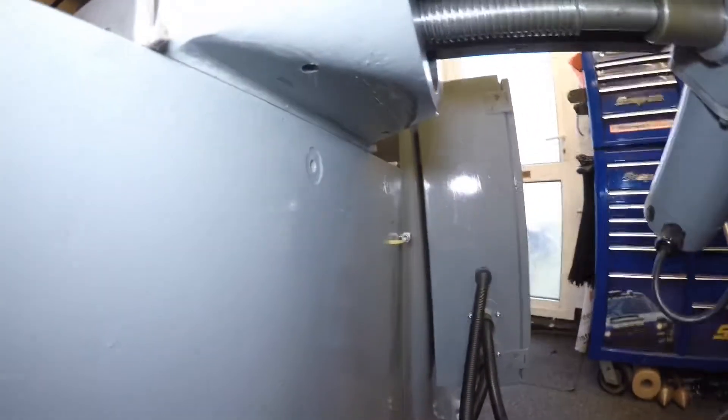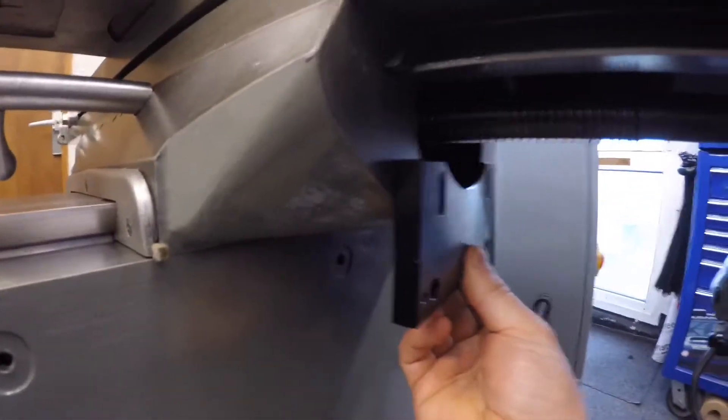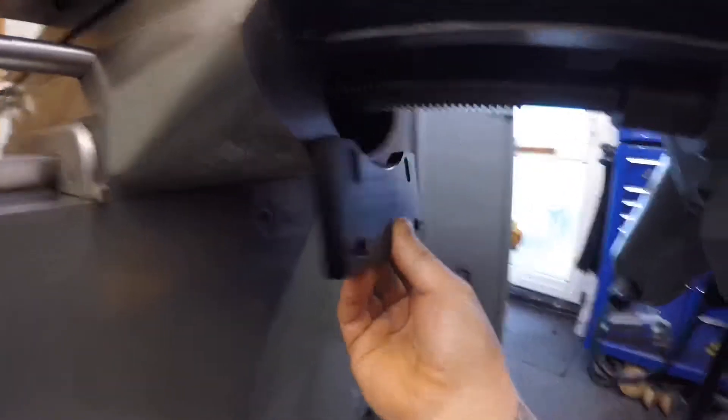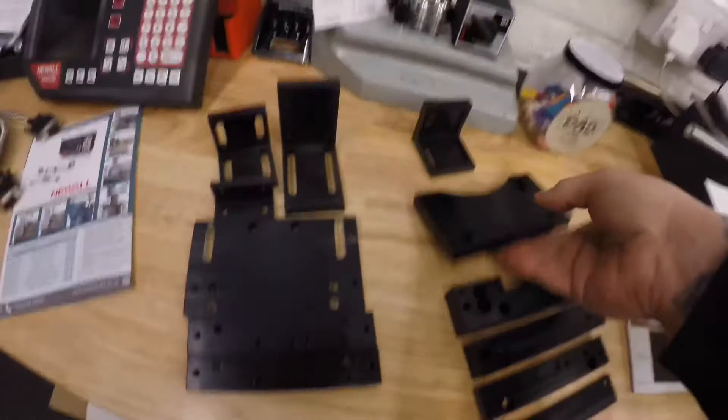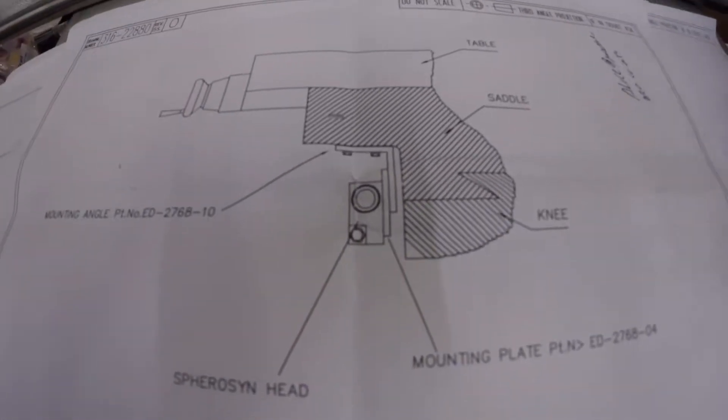I looked at the underside of the saddle and it's not very flat - it's angled. So I phoned them back and said that's the wrong kit. They said no it isn't, then I went on the website and showed them their own photos - and they agreed. They sent out this bracket which will mount on the side, and your reader head comes off of there. If you buy one of these, be aware they may send you the generic kit when really, for a Bridgeport-specific install, you want this one.